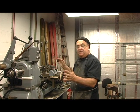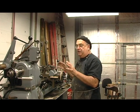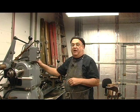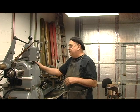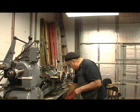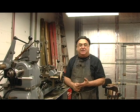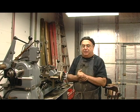I had an opportunity to get this machine — it was in New Jersey, so I didn't have to go too far. I got it off eBay but bought it directly from the guy through his website. The other big attraction was that it had an automatic threading attachment — a lot of them don't. A lot of machinery guys take these threading attachments off because they're about $1,500 used. It had some tooling with it and just a few collets, but I've got a complete set of Hardinge 5C collets, three different dead-length collets, soft-jaw collets, and some larger ones. I'm pretty well tooled up.